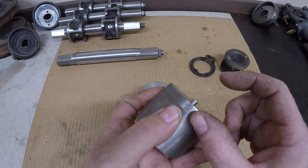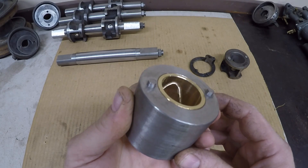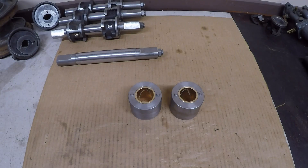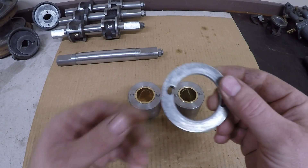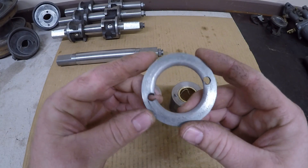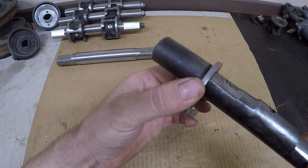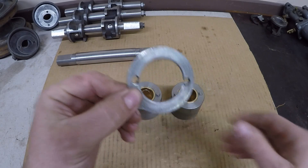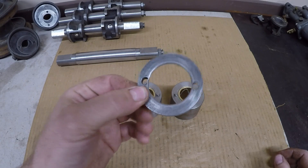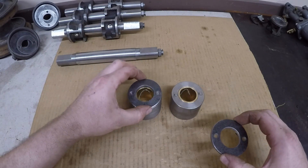The dowels were still long when I pressed them in, so after getting them down in place I cut them off to the desired length. After completing both bearings, I turned my attention to the thrust washers. The one from this roller was horrendously worn, not reusable — it had been cutting a groove in the shaft. Once again I could not find these smaller thrust washers available new anywhere, so I had to make a new set of those as well.